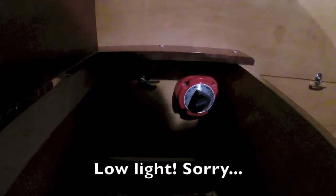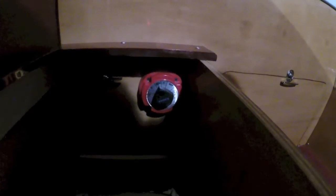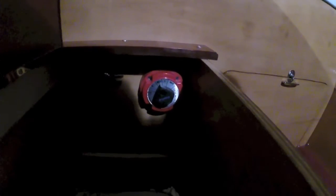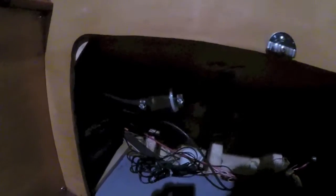While this is open, there's the fuel selector, which switches between left and right tank or a center shutoff position, and also a battery switch which you can select both batteries or the left or right battery individually. This means that if you camp using the house battery, you have a fresh unused battery in the morning for starting the engine. There's also the blower, the bilge pump in the bilge area, and the fuel line with a fuel filter that is changed every season — very accessible.